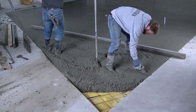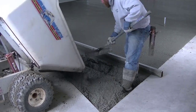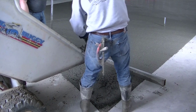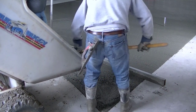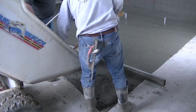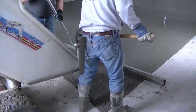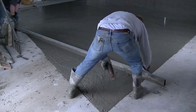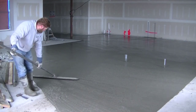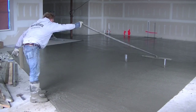It's really important that when you pour your matching concrete you get it perfect. You don't want it low, you don't want it high. Otherwise it's going to create a lot more work when you go to finish — especially if it's low, because trying to fill it back in is a real pain. If it's high you can scrape it down a little bit, but low is tough. We're going to just shovel the rest out. That should be all the concrete we need. They call it a mud buggy — it has a lot of power; we've used it going up hills and it'll haul concrete up pretty easily. Now Darren's going to finish bull-floating and then they'll have to sit and wait an hour or two before they can start finishing.